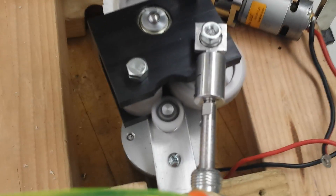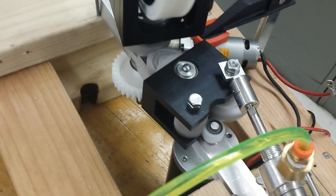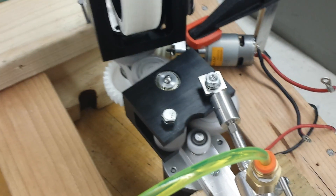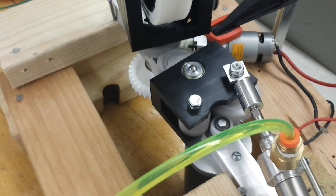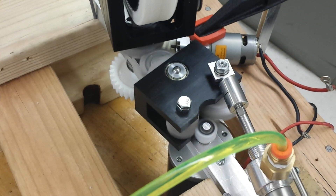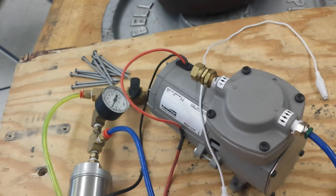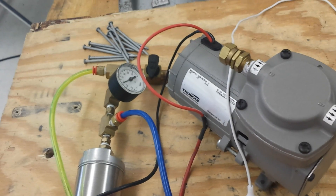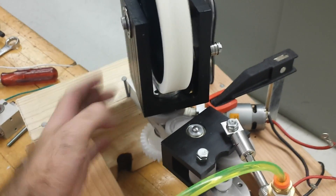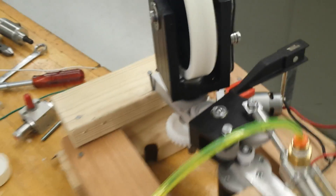As you can see right now, it's in one of the gears — it's in low gear. Or rather, high gear. And then when I flip it — right now it's in low gear. As you can see, the transition was extremely smooth and more or less instantaneous. There was no delay whatsoever, and I can go back the other way. There's absolutely no issue in regards to shifting. I need to pressurize a little bit more because there's a leaky system and it's a pretty big bore piston, so there's a lot of volume being consumed. Now, the reason this turns is because the steering motor keeps sliding, but once that's rigidly attached, this won't jitter when it's engaged.